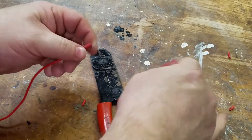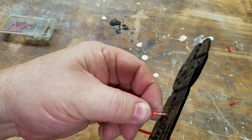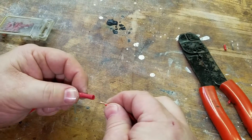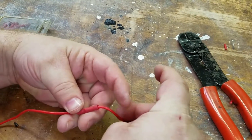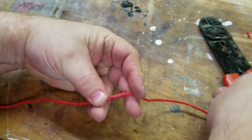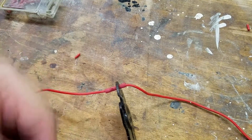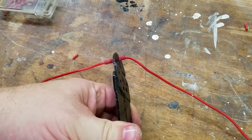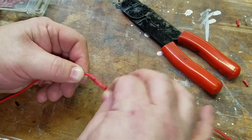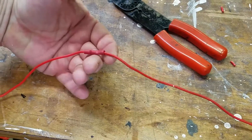I've still got too much wire there. We push it in. And you can see this bell, which is where I crimped on the first one — that was my mistake. You want to crimp inside that bell. See how I'm inside there? That's where the aluminum crush sleeve is. Just push down. Now, no matter how much shaking and vibrating you go down the road, that's not coming loose. This is really the way that joint should be made.